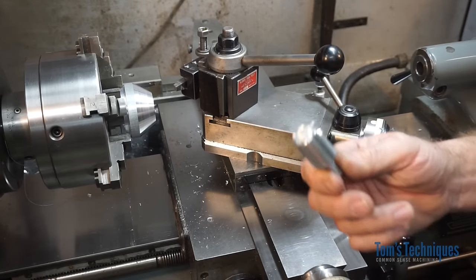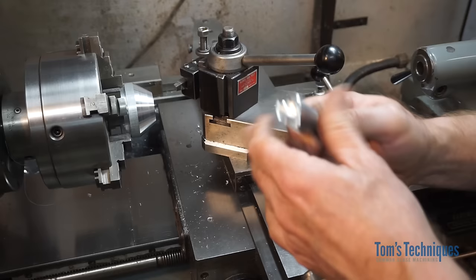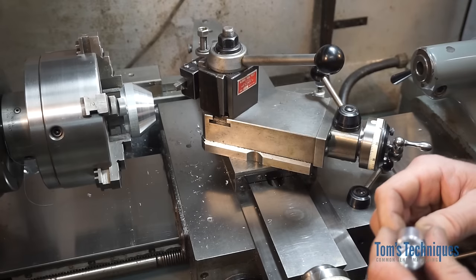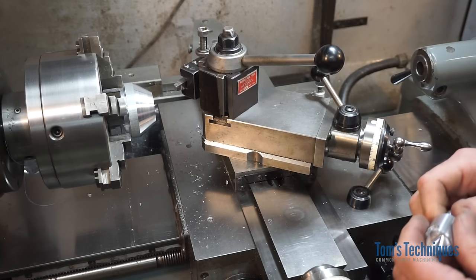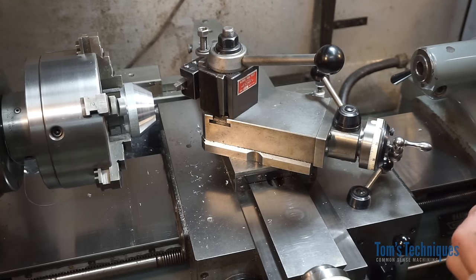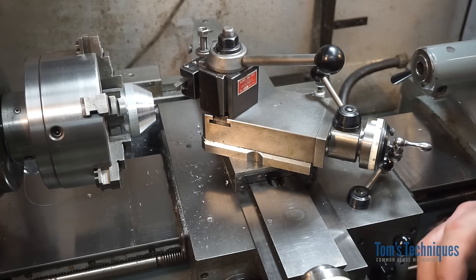And it works really well. The compound's not the only thing you can use this technique on. I also use it with a similar socket on my rotary table on the mill, and on a dividing head. Any time you have to crank by hand, this thing works great. You may have even heard of guys using it on the knee crank on their mill for cranking the table up and down — unless you have a power feed on that. I know they make them, but they're kind of expensive. Maybe you can just use your cordless drill to do that.